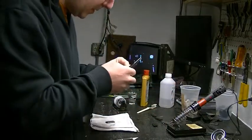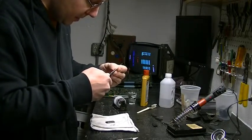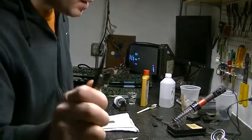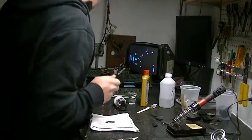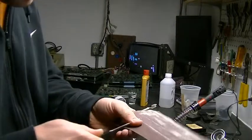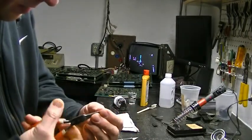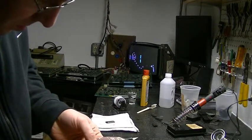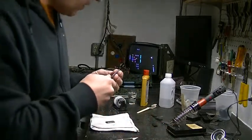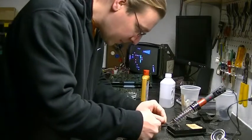Take your pliers again and flatten out the edges — get it so you just have a little bit of the top sticking out. Then get yourself a piece of sandpaper and clean the top and bottom sides of it, shine it up real quick on both sides front and back. Now come back to the soldering iron and tin the leg with solder on both sides.